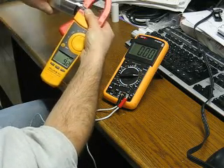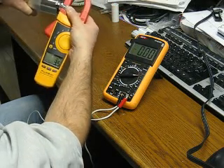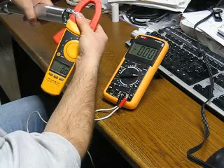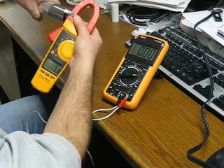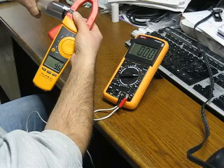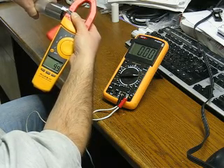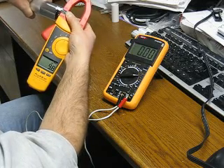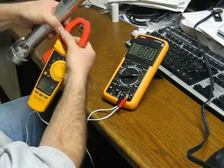I'm looking at the output of this — it's not quite blue yet. That's because even with me pressing on this clamp and this piece of metal, I'm still not providing the same kind of low resistance, full-force contact that the golden shorty spring provides inside the mag light. I'm almost at 10 amps — 9.8, 9.9 — before my hands start to slip.